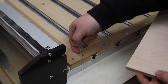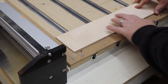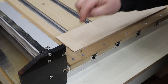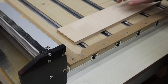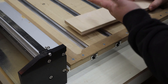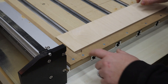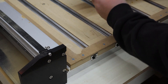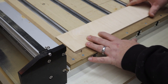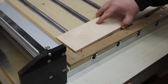Here's what I was talking about, and the reason that I cut out an extra little circle here. It's so that when I put pieces of material in, I can butt them all the way over and to the front, and the rounded part doesn't interfere with the corner referencing. I could have easily just chiseled this out, but I had the router out and the CNC going, so why not just let the machine do the work. This can also act as a sawdust well of sorts — if I put a piece down and slide it back, it could push the sawdust in here, giving the sawdust somewhere to go so I don't end up placing my material incorrectly.